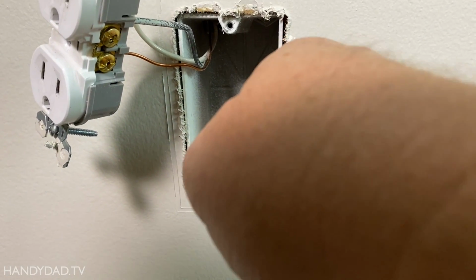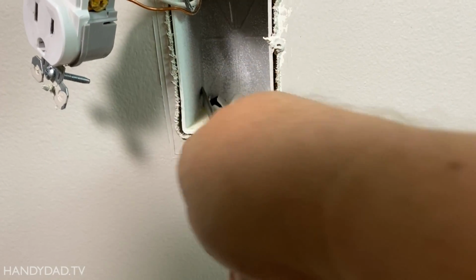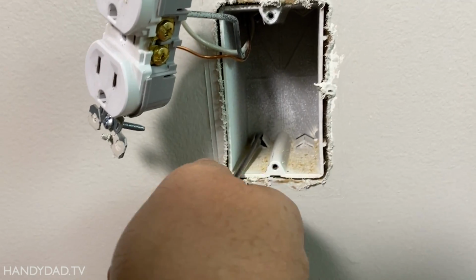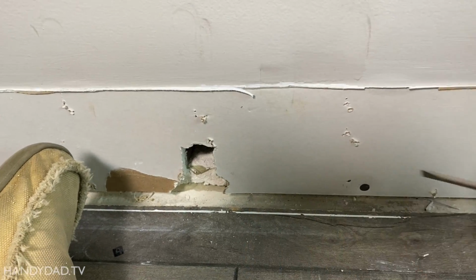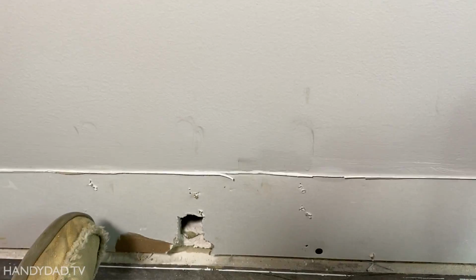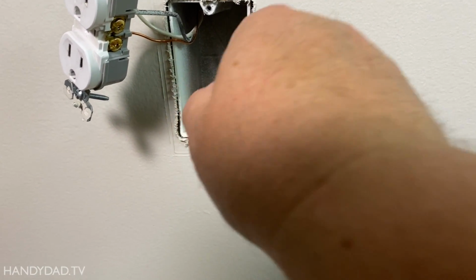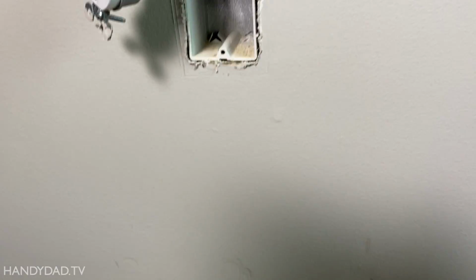And you can see this outlet is what I call the end of the run because it has nothing else attached to it. So we're going to attach another wire to it, and I'm going to run it from there down to here because this is going to be hidden behind cabinets, and you'll see it's going to be a utility outlet for the fireplace to plug into. But anyway, I'm going to run it with a coat hanger. I'm going to go down to here and tape a wire on and pull it up.